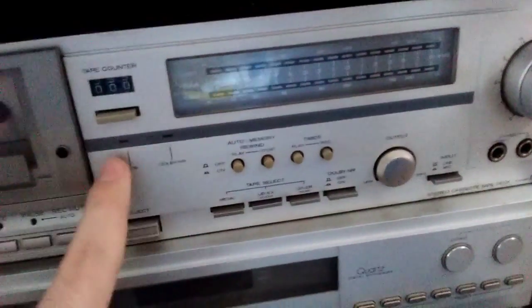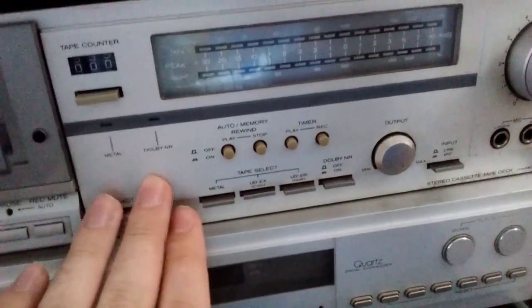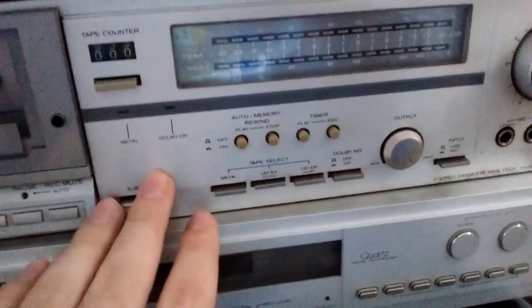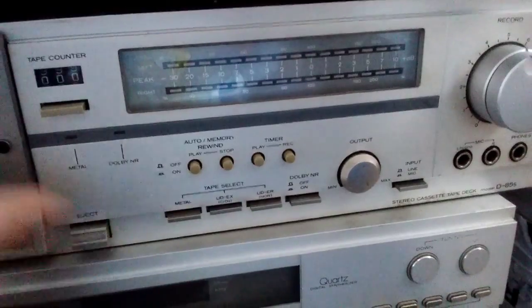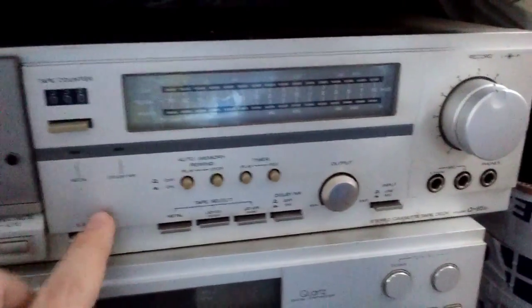The relay on the Hitachi is some proprietary kind of relay which I can't seem to fix. I've tried cleaning the contacts, I've tried sanding them down a little bit, and I just cannot seem to make this thing work properly. The problem is I'm losing one channel — the left channel — randomly. So right now it's in storage with its tuner, and my old turntable too.